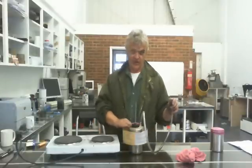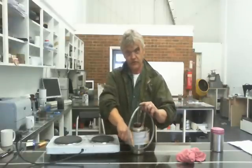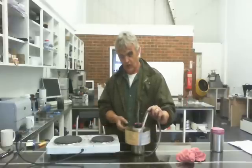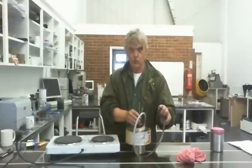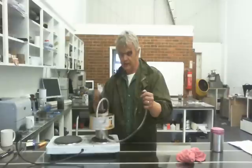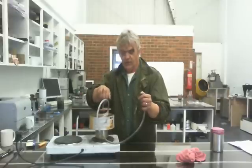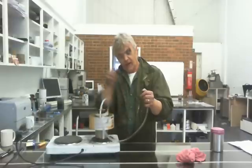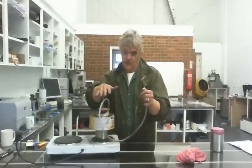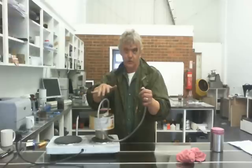So we can see that using this. What I've got here is a canister, and the displacer this time has a rod in it so I can actually move that displacer up and down. And in that tube we've got some coloured water — that coloured water in the tube is acting like a piston, actually called a liquid piston. Now when I put this on the heat source, the air is going to increase in pressure or expand and we'll see that liquid move up and down. And there it goes, moving up the tube because the air is increasing. Now if I pull that displacer up, it puts more air into the hot region and so we get a bigger movement. As I push it down, the air moves into the cold region and you can see that it moved up to there. When it's in the hot region it moves that way; when I push into the cold region, it moves the other way. So that change in pressure is causing that liquid to move like a piston.